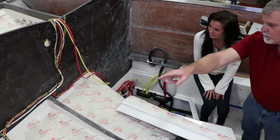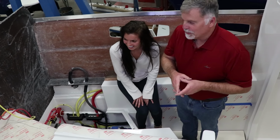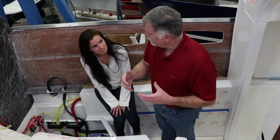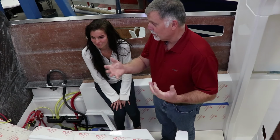This little compartment on the left side, there's an air conditioner that fits in there, and it's a 16,000 BTU air conditioner going in there. And there's another one that goes up on the flybridge. So this boat has 32,000 BTUs of air conditioning. So plenty of cool. And if it's a hot day, you need that. And actually down in Florida, where they'll have water that's 80 or 90 degrees, an air conditioner that's 16,000 BTUs in 70 degree waters doesn't have quite that much capacity. So that's why we go big on the air conditioners, because you still want to stay cool.